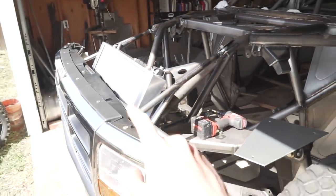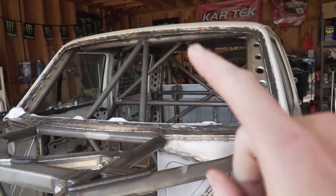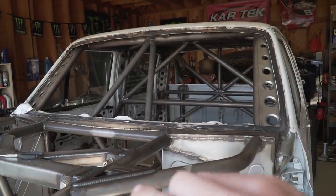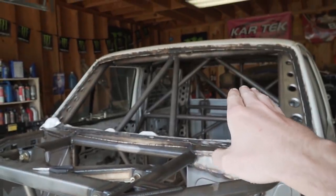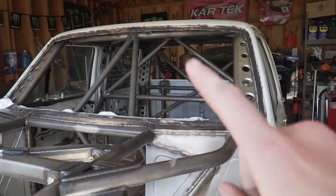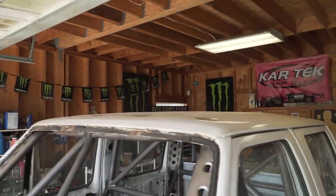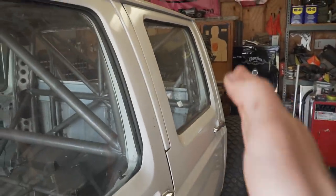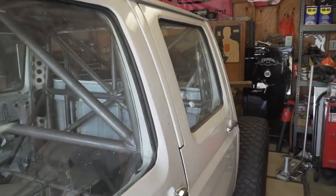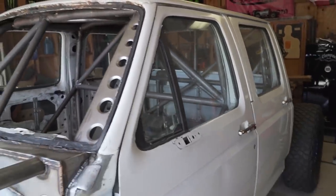The reason we mounted the radiator in the front of the truck instead of in the rear is because most race trucks don't run a windshield or a back window. So all the air can flow straight through the truck and straight to the radiator without any issues. On this, when you have a windshield and a back window, all the air has to go up and either over the top of the cab or from the side and then have some scoops going in. So I didn't want to deal with any of that, having to make scoops for the radiator, nothing like that,